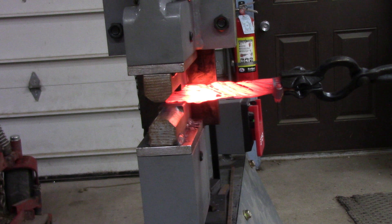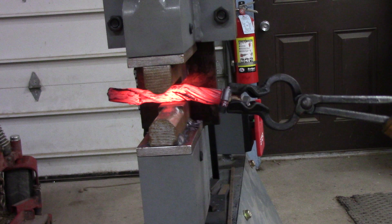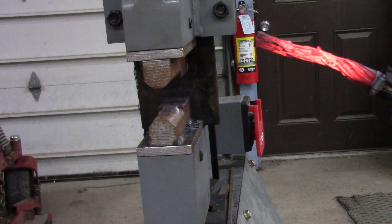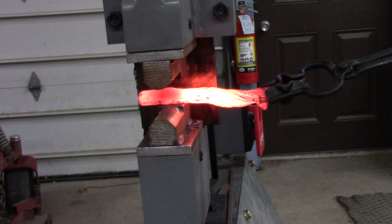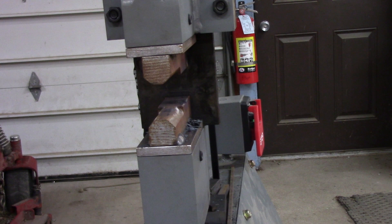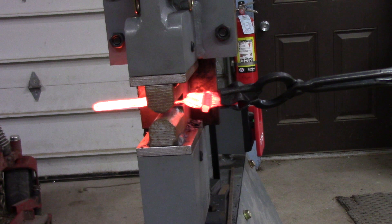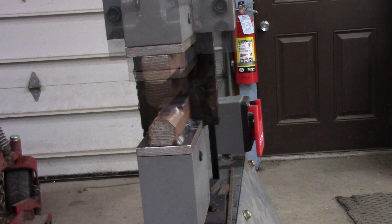I'm trying to twist it a little bit tighter to get it all to weld together better. There are a few pieces flying out that are never really going to stick. A little more prep could have helped — getting the ends welded together better, twisting tighter to start with, and having some round rounding dies for the press or a swage block would have made a big difference. Better tooling could have made this a lot easier, but about this point I started to realize I might actually get something solid out of this.